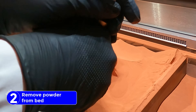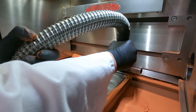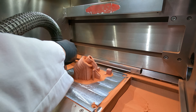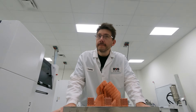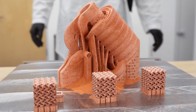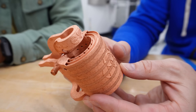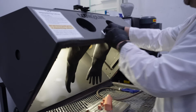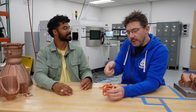You have an idea where they are on the build plate, and as you're going in with a shovel or a trowel, it's like you hit pay dirt. After you've done your part being Indiana Jones digging the bones out, you can take it over to the media blasting chamber — but we're not using media, just air. You just want to make sure there's no powder left. With all those tiny little channels, that powder is really minuscule so it can get into places. So we put it in the blast chamber and hit it with compressed air, and that was fun.